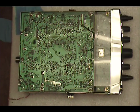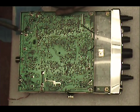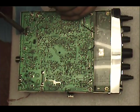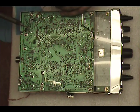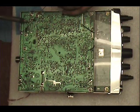This radio is for James in Washington, D.C. First thing I'm going to do is just apply some fresh solder to each of the legs that I intend on unsoldering — the process is much easier. This capacitor here, this transistor, this resistor. I might be putting something here later, so I'm going to put some solder on it.